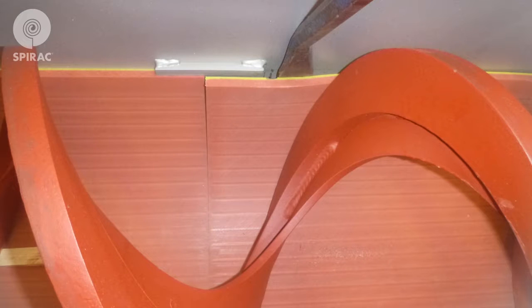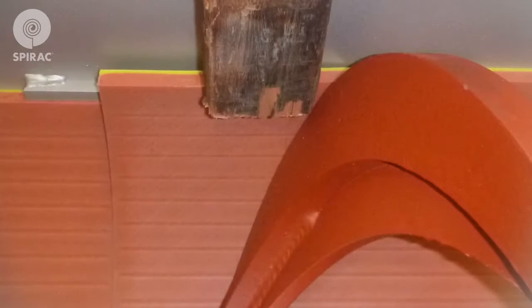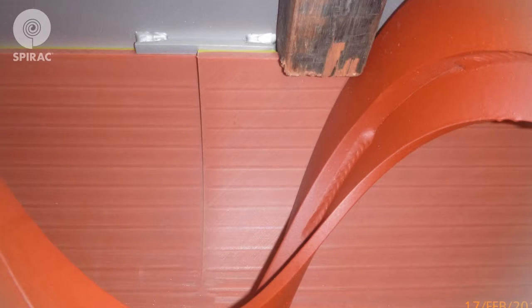To remove the liner, use a pry bar. Place it behind the liner next to a liner cleat and pry out the liner until it clears the liner cleats. Use a block and a hammer to drive the liner around the spiral in order to remove the liner from above. A worn liner may require little or no force to remove. To install the replacement liner, put it in the reverse order that the worn liner was removed. Once you have slid the liner around the spiral, it may be necessary to use a block and hammer to drive the liner into position. Seat the liner under the liner cleats to secure it in the trough.